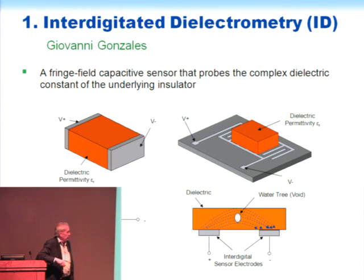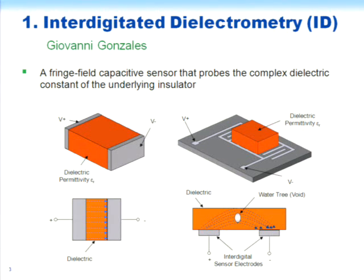Whereas if the cable is very healthy, then the properties would not change as you apply this electric field. So the idea there is if you can't turn off the power to make the measurements, use the voltage or electric field that's normally delivering power and make these measurements, interpret the characteristics of the cable inside, the insulation inside.